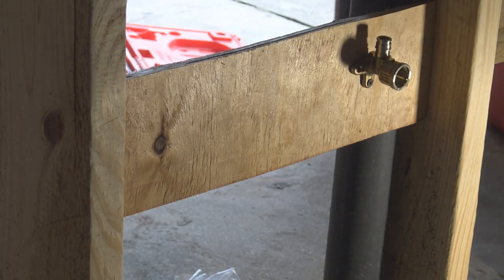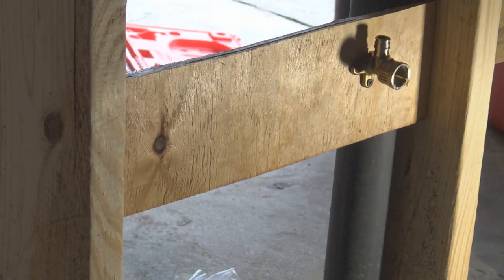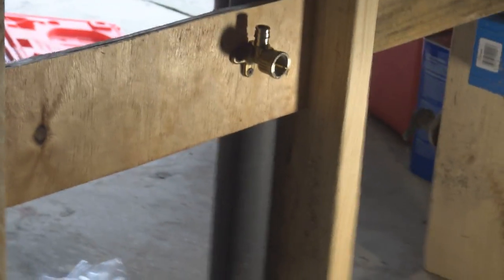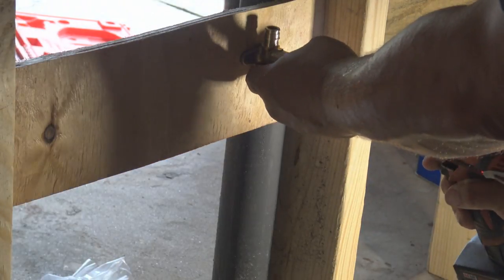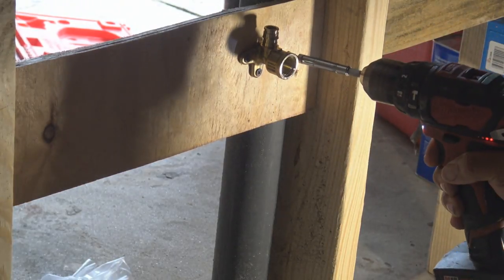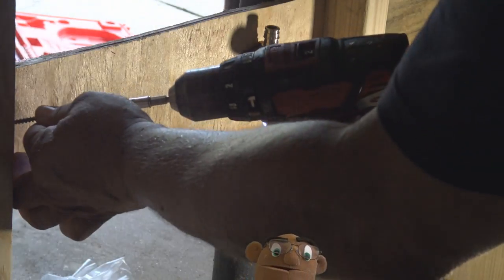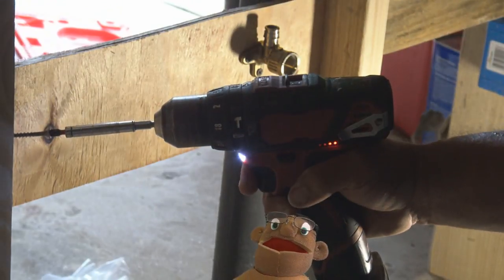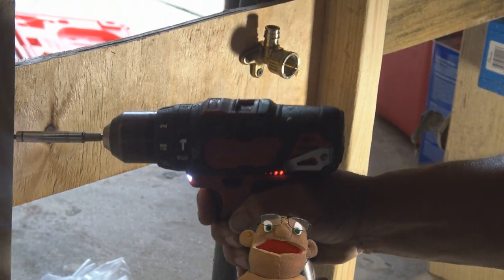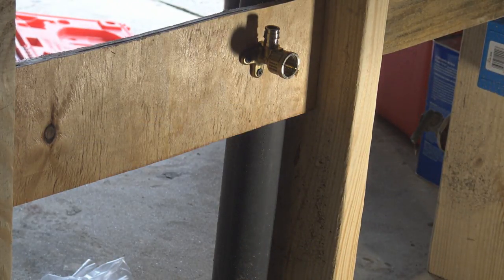And here we're back on the other side of where the water heater is. This is going to be the kitchen area. So we're going to put our drop ear 90s here, half inch again. We're going to use three for the kitchen sink, because there's one hot and one cold to the faucet, and then we have another hot that's going to go to the dishwasher. But they're all going to come out from up under the cabinet, right next to each other.